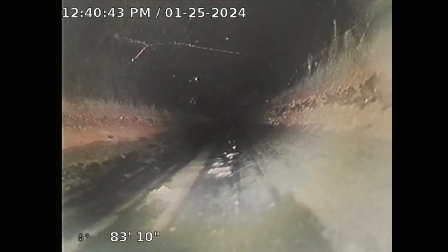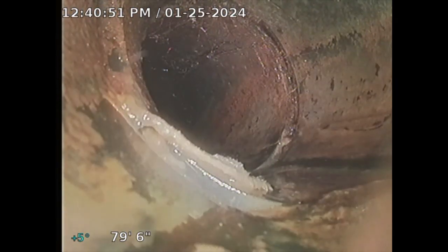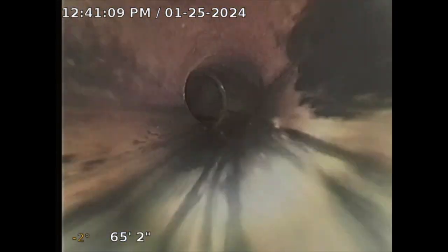You're looking at $5,000 for that repair at that main sewer line underneath the driveway pavers, 7.5 feet deep, to do a spot repair — approximately $5,000. Now I'm just retracting my camera and I'll be done with the sewer line inspection. All this looks good underneath the house. There should be a clean out installed at the front — I didn't locate it. There might be one; the property was built in 2000, so there should be.